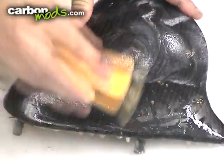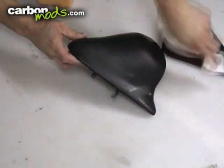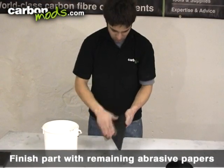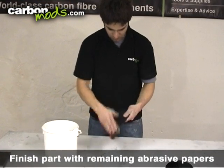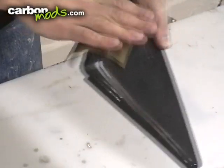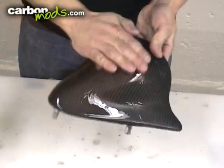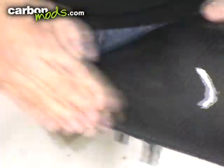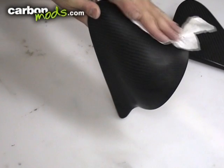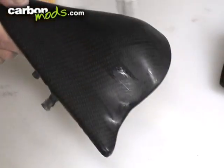Make sure the part is smooth and flat all over. If you give the component a little wipe down at this stage it helps to identify any problem areas, and then you can move on to the next grit. It's a good idea whenever you're changing grits to change the water — it stops any granules from the previous abrasive paper scratching the surface. Work all the way through the different grits, right the way up to the 1200, which will give you a smooth satin finish all over the part.